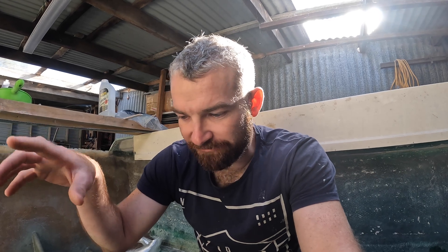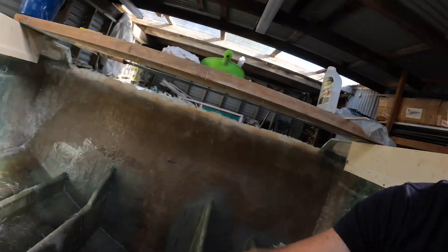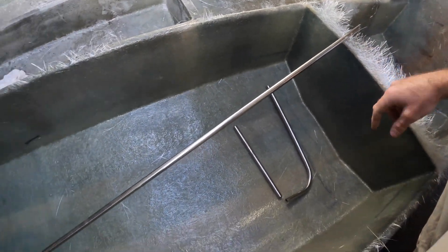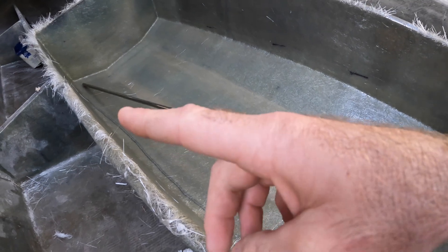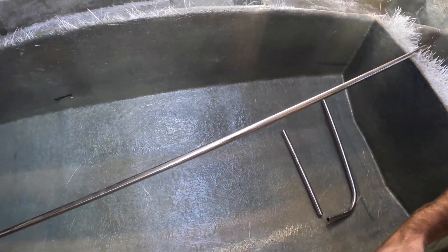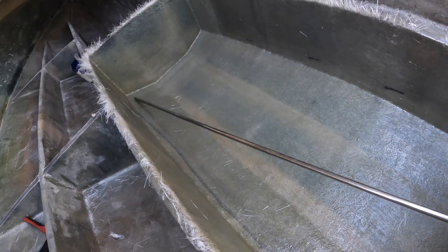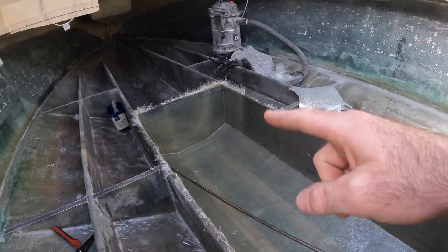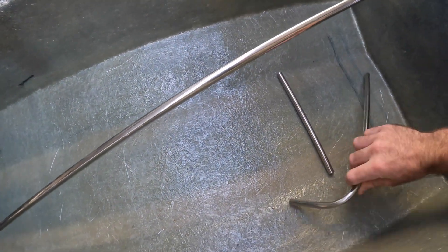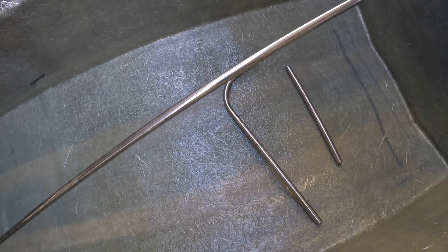As for where we're at with the fuel tank, we've got a forward bulkhead and a half bulkhead. I've actually glassed in three layers of fiberglass and tabbing around the corners and edges, so the inside of the tank is completely glassed in. We've got a false floor in the bottom so we can drain water from in front of the fuel tank back into the bilge well.